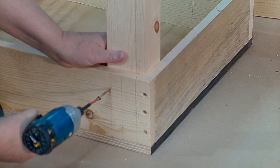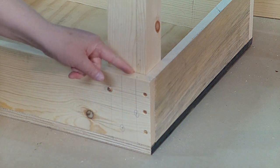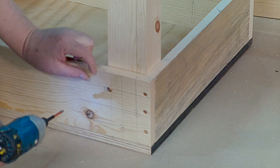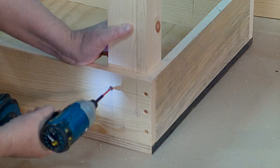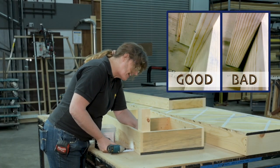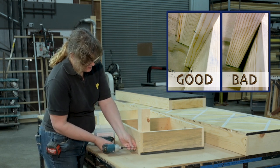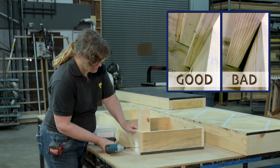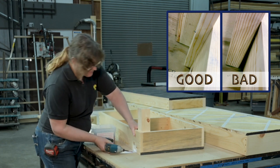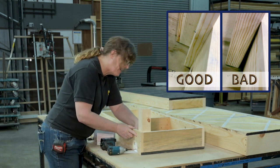Remember with this first screw, I need to get it completely flush. I've just created a little gap and I don't want that gap, so I need to keep going until the head gets sunk below the surface and that gap is gone. I want to look over here and make sure there's no gap down there before I continue screwing. Then I'll put the next one in — sometimes it pushes things away a little bit, but I'll go until that's below the surface slightly and my gap is gone.